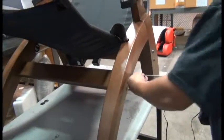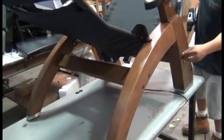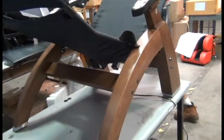The first thing we're going to do is loosen the front two screws. Those are 5/32 inch allen screws — just loosen those two front screws. Do not remove them; they still need to be securing the leg.